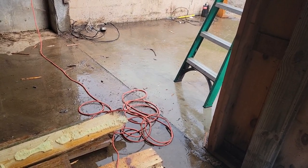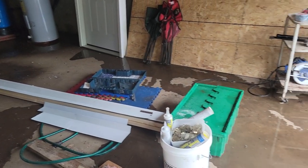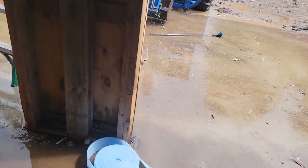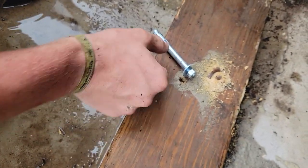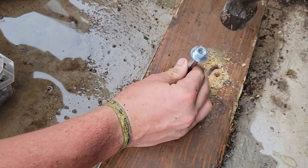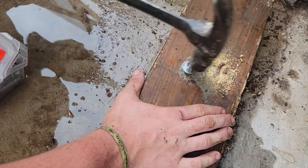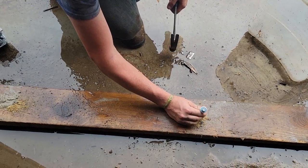Dawson's moving all the materials because we're going to end up with inches of water in here. I think the best thing to do is remove that slab, but that's not in the budget. This is called a sleeve anchor — drilled a 3/8-inch hole and I'm going to tap it down so it just touches, leaving room to tighten the nut up. Dad's got the Bulldog Extreme drilling holes in the concrete.